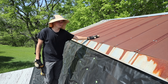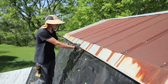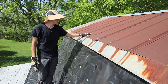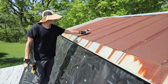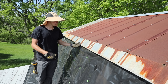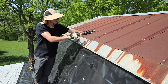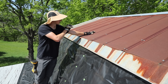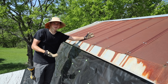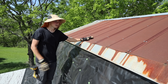It is probably the hottest day of the year so far so we picked a great day to be peeling off this hot metal roof. This is the original galvanized metal roof that came with the shed - it was put on in about 2003 and you can see it has a kind of rusty patina now. It's towards the end of its life because the zinc in it has pretty much gotten used up and it's starting to get all rusted. We actually kind of like this look and we want to take off this metal and reuse it for some decorations inside the house - maybe on the ceiling in the kitchen or some other places.